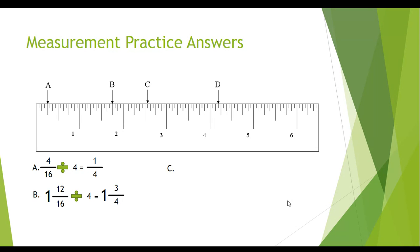On to C. When we look at C, we see that we're now past the second inch. So the first thing we do is write down the previous inch — in this case, 2. The next step is always the same: write down the 16 with the fraction bar. We count up the lines, starting with the first small mark after the second inch. Remember, they always restart when we go past the inch line. If we count each mark until we get to C, we come up with 9 — giving us 2 and 9-sixteenths.